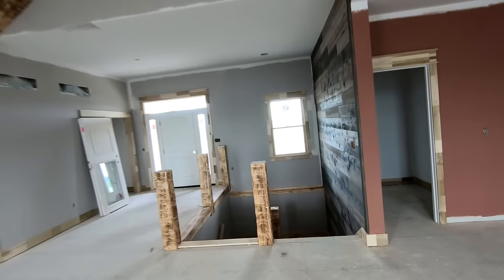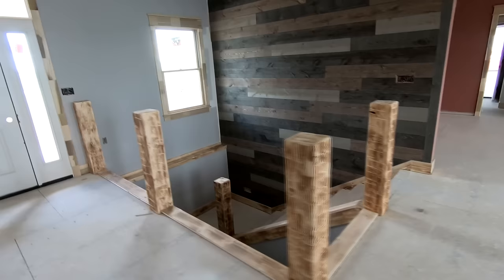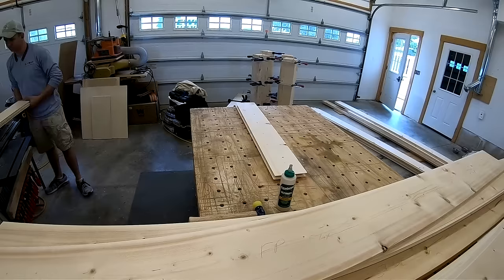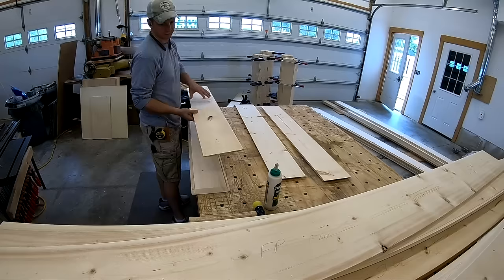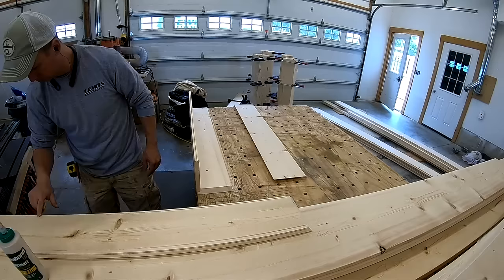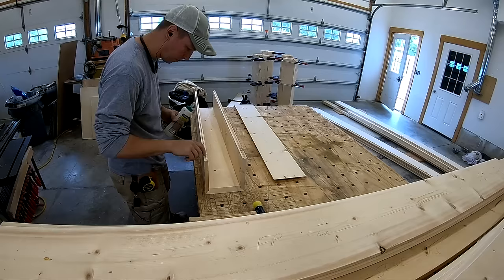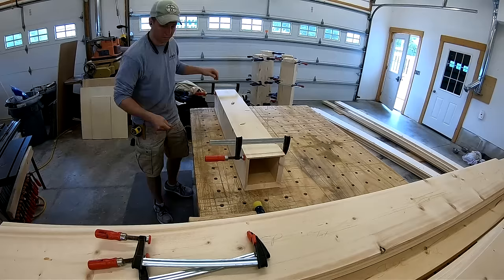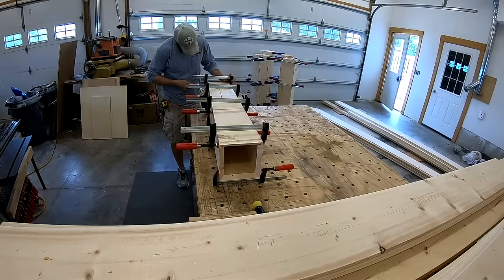In this video, we're going to talk about how to make your own rustic barn beams. One of the first questions you'll have to ask yourself is what material you want to use. I've found by far the best material is number two pine. It's going to be knotty, but most importantly very soft, making it easier to hew with the broad axe and other machines. It distresses really nicely, and the soft growth rings respond well to a wire brush wheel. It's also very inexpensive compared to something like white oak, so my go-to is number two pine.